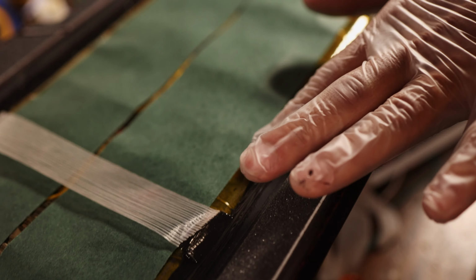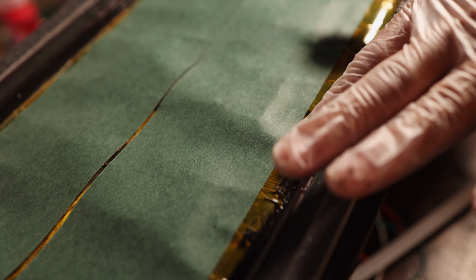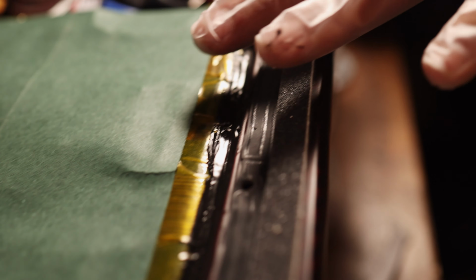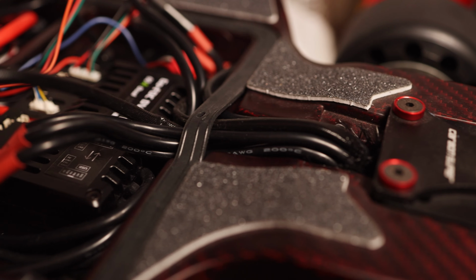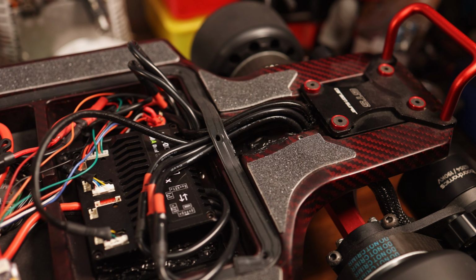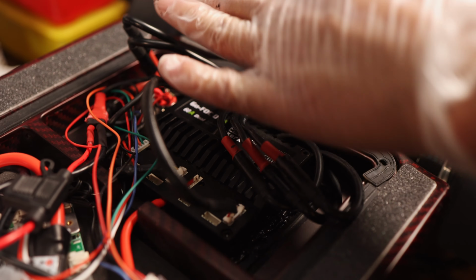In this step, we're going ahead and putting silicone on the battery, and the main reasoning for this was because there was literally no room for adhesive or hot glue underneath the battery, so we went ahead and used silicone on the sides to help keep it in. And while this is obviously going to sort of put it in there permanently, I didn't really want to open this up after we put it in here.